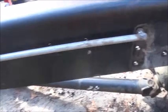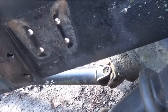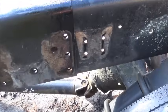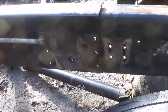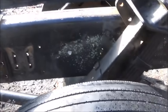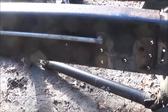So we've got these done, we're ready to bolt the rear end forward, except for we've got these little 3/8 holes to do for the overload brackets. So what I'm going to do is redo this. I may grind it down just to fit in the hole, it don't matter the bolt, just make it fit, and then we're going to go 50 inches forward on them. We'll have to move this rear or raise this up and come forward 50 inches for that one. We'll get them 8 holes on each side drilled, and then we'll be ready to bolt the rear back into place. So we should be finished up with this today, shouldn't be a problem.